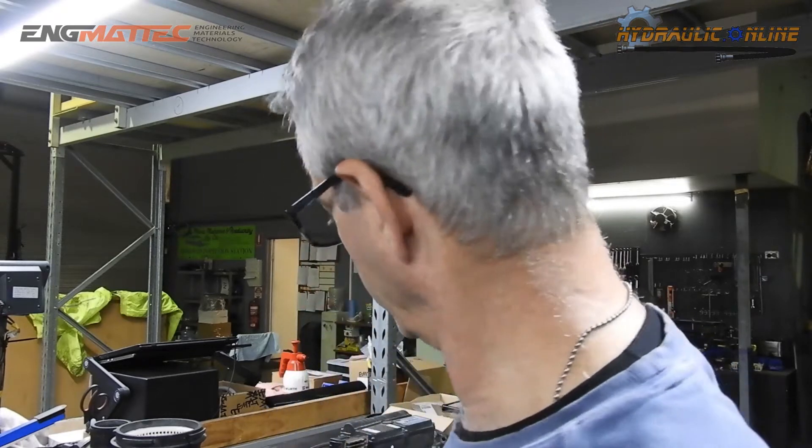Hydraulics isn't just about high-pressure oil — hydraulics is really about fluids. So this water pump has a one-and-a-half horsepower motor, but it's designed to flow large volumes at very, very low pressures. For example, at about 30 psi it will flow 150 liters of water per minute. But if you reduce that pressure — in other words, you don't have to push it through very far, or you have a clean filter — it could pump up to 450 liters per minute.